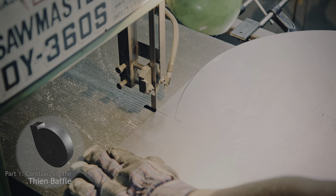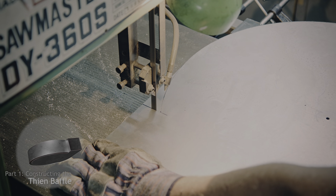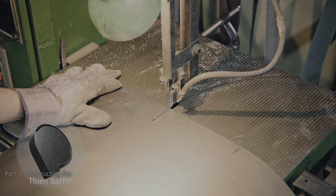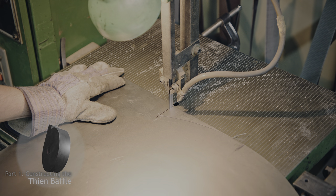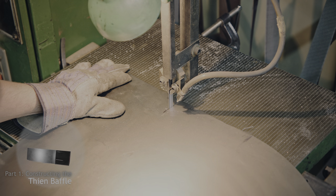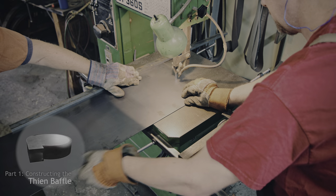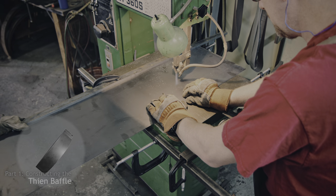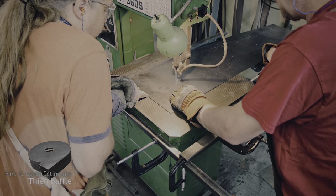For the baffle to work, the compartment into which the dust will drop needs to be airtight. Otherwise, airflow would move through the dropout in the baffle and prevent the operation. Now we are completing the bottom part of the baffle. The top part of the baffle will receive a 6 inch diameter circle in the middle where the blower will be positioned, and the bottom part of the baffle still needs more material removed to create the dropout. Before we do that, we need to cut a 6 inch wide strip of sheet metal that will form the outer wall of the baffle. Since we don't have a shear, we mounted a guide on the bandsaw table.